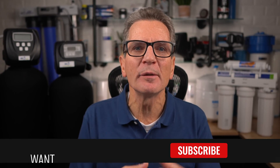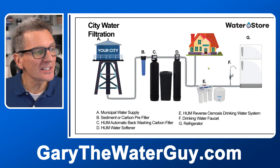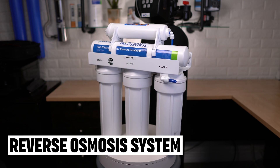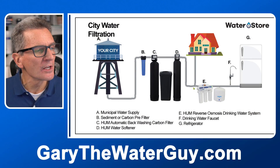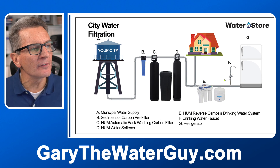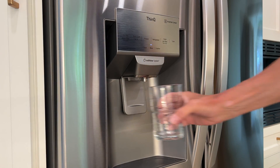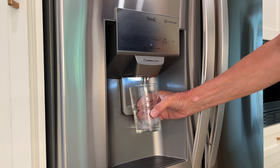To remove contaminants and excessive total dissolved solids like salt, potassium, copper, aluminum, nitrates, uranium, lead, fluoride, arsenic, microplastics, forever chemicals like PFAS, PFOA, pharmaceuticals and personal care products, and to create a barrier from bacteria, you would add a reverse osmosis drinking water system. This is where you'd install one of our Hume WaterSaver 75 high efficiency reverse osmosis drinking water systems. This is not a whole house system — it goes after the whole house filtration. It gives you super pure reverse osmosis drinking water for your family at one faucet, and if you have a water dispenser and ice cube maker in your fridge, it would also be connected there.